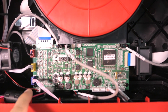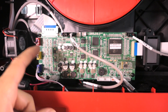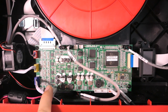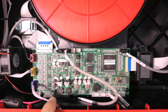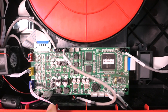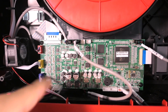I used a benchtop power supply where I can adjust the voltage and amperage, and I connected it straight to the pins on the board. My thought was, since the board was bad already, if I fried anything I wouldn't worry about it too much. I gave it power at only about two volts with one amp, knowing something was directly shorting. I bumped the voltage up to about three volts, let it sit for five minutes, and felt around with my finger to find anything hot.